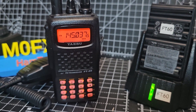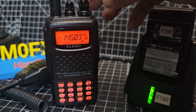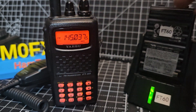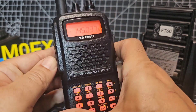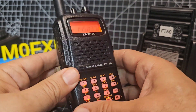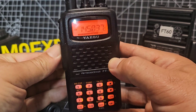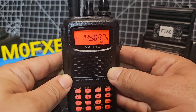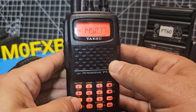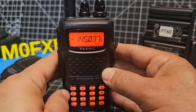Keep going with the basics: turn on, volume, change channel, squelch. On this side you've got your PTT and a couple of buttons. Press one — that's turning the squelch off, and that's turning the light on and off. You've got two programmable buttons — if you go into settings you can program P1 and P2.